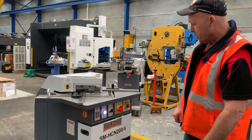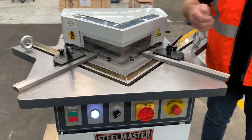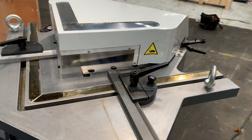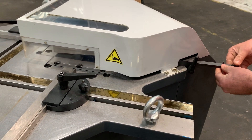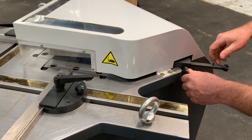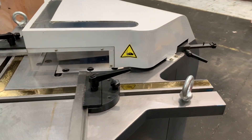So let's run around the machine. As I said, big heavy-duty front table. This is a heavy-duty industrial machine that'll last 50 years and years and years. One of the key features our customers like is the back gauge. Not many corner notchers have this — you've actually got a sliding back gauge that's calibrated as well, so you can set that where you're doing production runs and general cutting requirements.